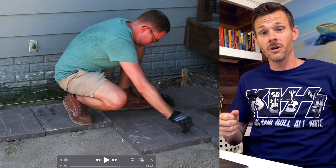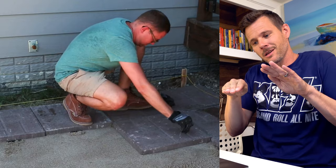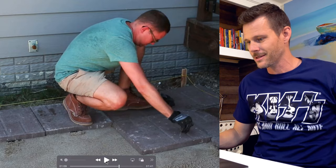Now, he may come back through. If you have a trowel, a trowel is a great thing. Make sure that space is filled in, because all of a sudden it's going to move. Things are going to shift. The pavers are going to move around. This is how you start to get dips and doodles and all that stuff.